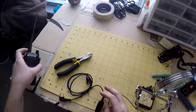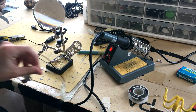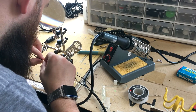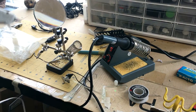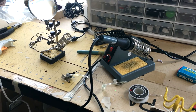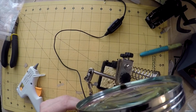Something went wrong with the last model I had — either the up or the down button wasn't responding. So now what you've got is a very easily damaged or ripped-apart joint. Some people will just use heat shrink and call it a day. My preferred technique is to protect the area with toothpicks and hot glue. One thing I like about hot glue is it's going to give me a waterproof seal and it's going to be durable.